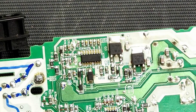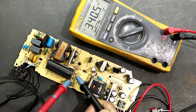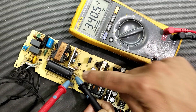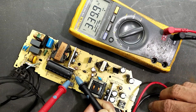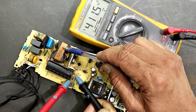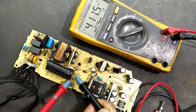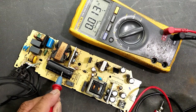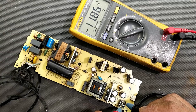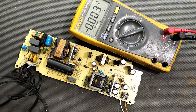I will use a series lamp to apply power. In normal power-on condition, when I apply 220-240 volt at input, I am receiving 340 volt DC at the bulk capacitor. When I turn on this switch, the PFC circuit will start and we will receive 411 volt at the PFC circuit. So our PFC circuit is started, and now I am taking 11.86 volt at the output connector.